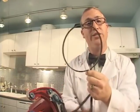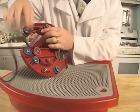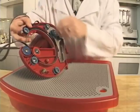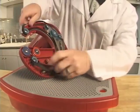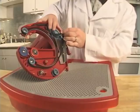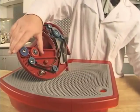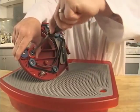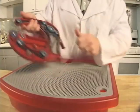Replacing the blade is just as easy. Make sure you have your belt groove side out. Drop your blade inside of the belt. Wrap it around 360 degrees and pinch it off so that you don't lose the blade. Drop your blade-belt assembly inside of the raceway, making sure it drops in between the blue pulleys. Wrap your belt around the top pulley, then around the bottom pulley, then flip your belt around. Wrap the belt around the upper pulley, down and around the drive gear, up and over the next pulley. Lift up on the spring tension arm and slide the belt under the pulley. Then slide the inner groove grommet forward until it makes light contact with the outer groove grommet and snug it down. Always rotate the drive gear counterclockwise to make sure everything is rotating.